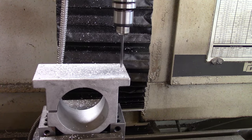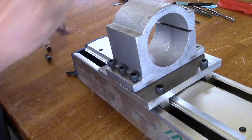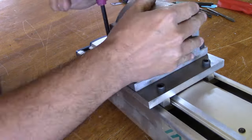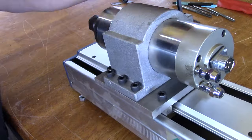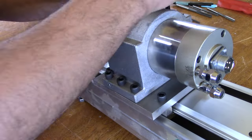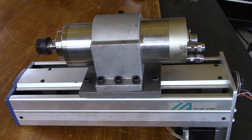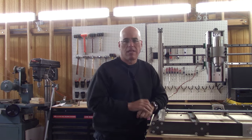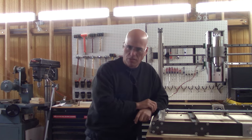I did finish the 8mm holes on the drill press. Once you get there, now we can mount it. Six screws and it's looking good. I may need to shim this because who knows what kind of irregularities I got on my job. But nothing like seeing that spindle mounted into the Z-axis. And there you go, YouTubers — how to mount your spindle into your Z-axis, officially transforming this gantry system into a legal CNC router.